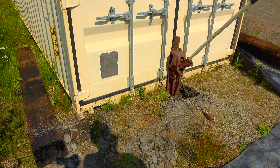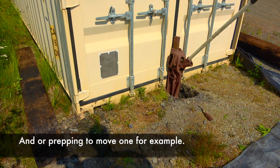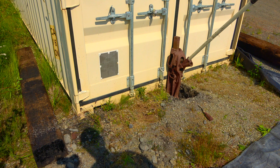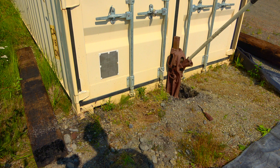These jacks are for lifting houses and stuff that have settled over many years. They usually recommend you give it like one crank a day, which is about an eighth inch, and let everything kind of resettle and reshape, then give it a crank the next day. It can be a lengthy process so you don't do structural damage or have things going too fast. I'll keep at this until I've got it lifted up. I won't make you sit here and watch me crank it each time.